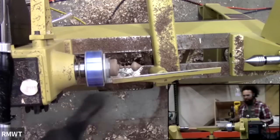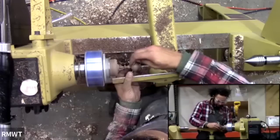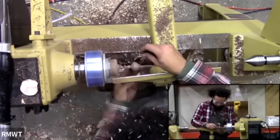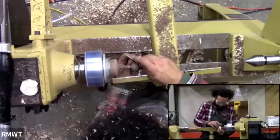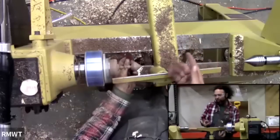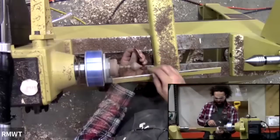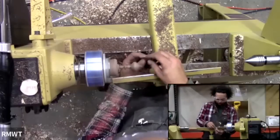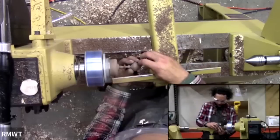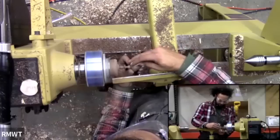That'll be good. That's 400. 400 is going to be a good finish after the 220. It's cut clean enough that just a higher grit after the 220 will be good. I actually like sanding with little 2.5 inch pads because by the time it reaches a corner, it will be a circle. Then it's convex. It's not facing inward, and it has a tendency to not want to round over, to roll over fine detail. If I'm going to sand fine detail, which I rarely do, it's only if it's anything about 220 or less, just for fine detail.